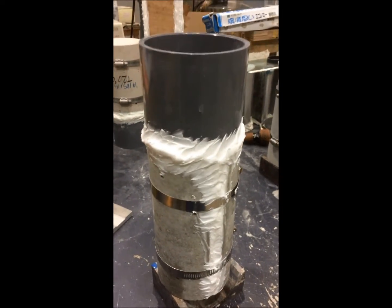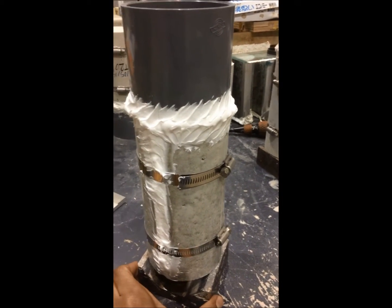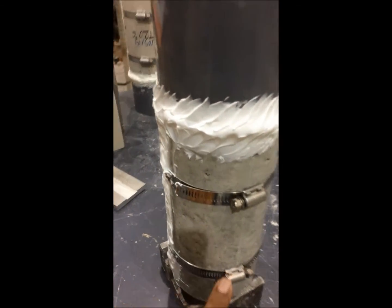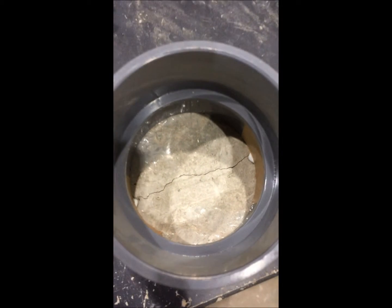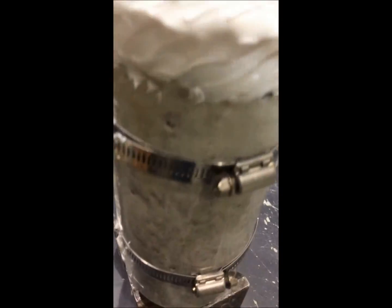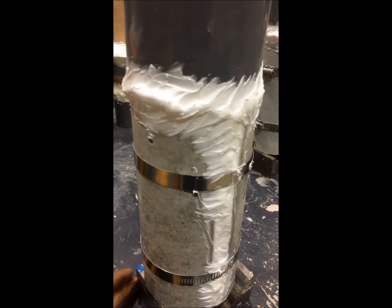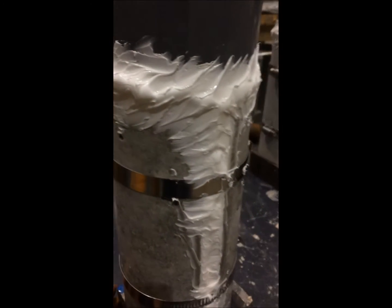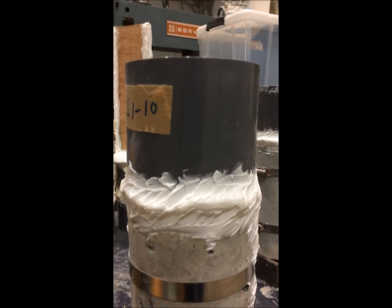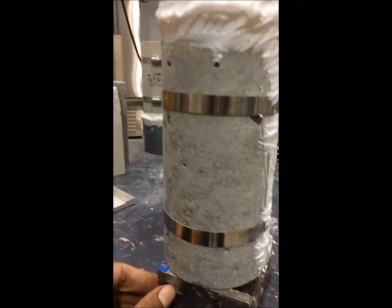This is now the specimen we have finally made. I was able to bind it with this metal clamps — here you can screw and tighten at these positions. And if you look inside, our static penetrating crack goes through the specimen, and of course it goes through until the bottom, following the V-notch. After binding together, we then apply silicone, plus this 8.5 cm UPVC pipe on top, which will be our water container supply when we are doing the water permeation test.